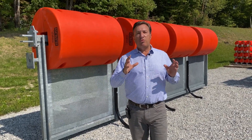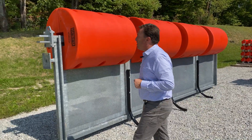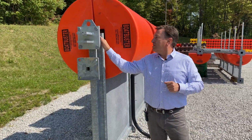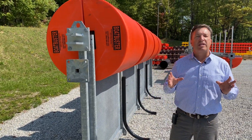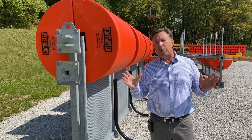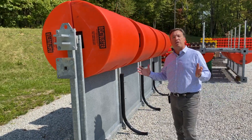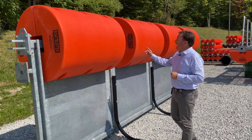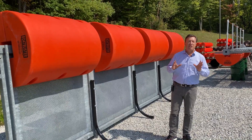Each module is 20 feet long and floated by our Boat Buster floats. But really what the Boat Buster 20 is, it's a heavy duty steel barrier. We have a 4 inch diameter steel tube that goes through the center, and to that we weld screens. Our standard screens range from 2 feet deep down to 10 feet deep — we can go deeper, but we prefer to hang netting below 10 feet. It's a massive steel frame, engineered to be tough and engineered for heavy debris.